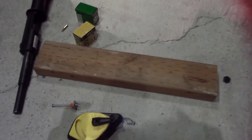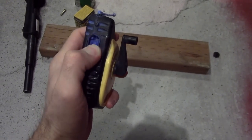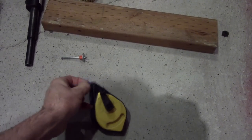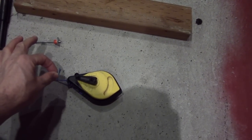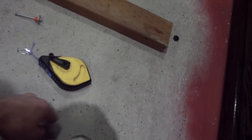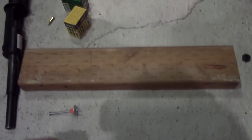Let's go get the other parts you're going to need. Here's what you need to nail one of these down to the ground. This is a chalk line — it's got a little chamber in there filled with blue chalk. You pull the string out, hold it down on one end, run to the other side of the room. You may need somebody to hold it. Then you pick up the string and let it go — if it's pulled tight it'll snap across the ground and make a nice line. That way you know you're placing this nice and straight and not crooked. Not mandatory, but really helpful.